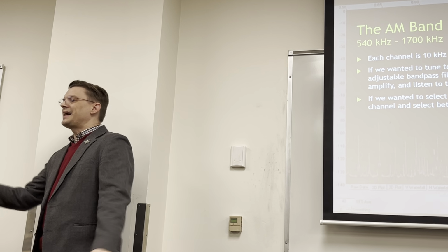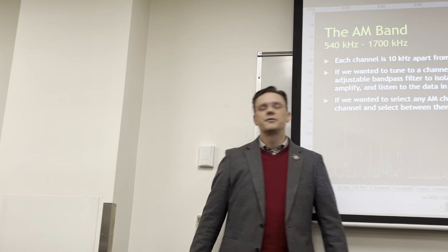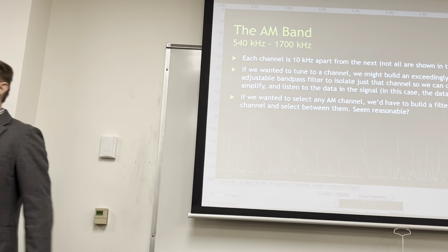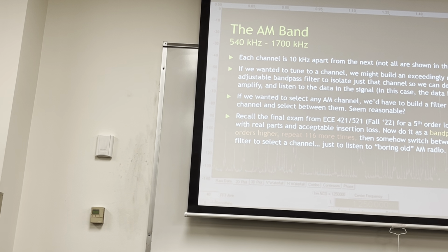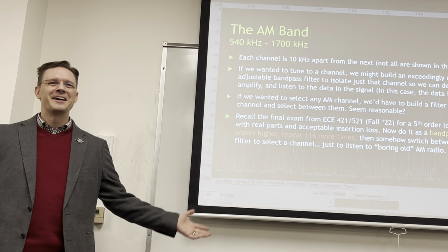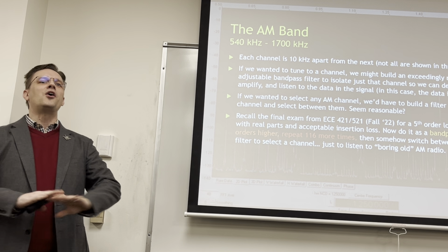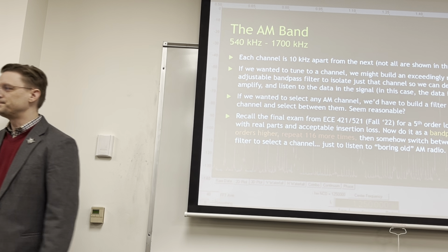So if I wanted to select an AM channel, maybe we build one for every channel. There's 117 channels. So remember, on your final exam, you just did a fifth order low pass filter with real parts and acceptable insertion loss. Now do it again as a band pass filter, several orders higher, and do it 116 times in a row, right? Seem reasonable? No. Anybody doing it for a project? No, that's your final. No, it's not. Somehow switch between each filter to select a channel, and this is all just to listen to AM radio, which no one wants to hear in the first place, right?